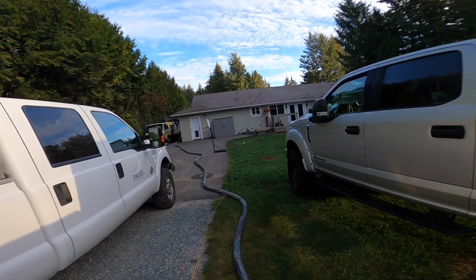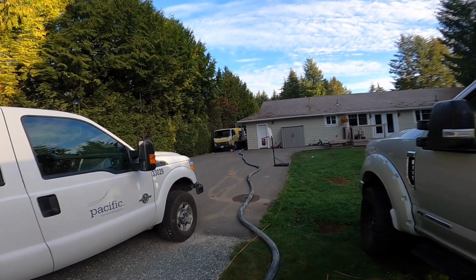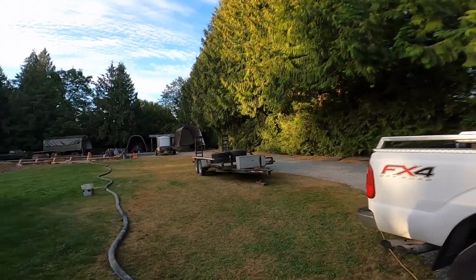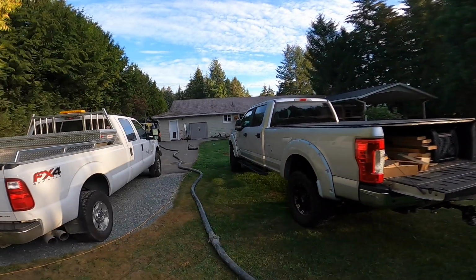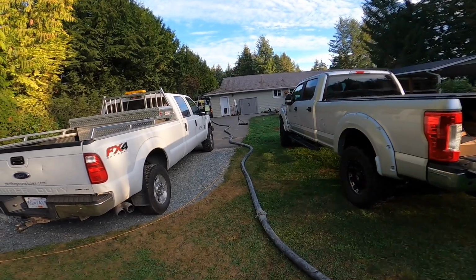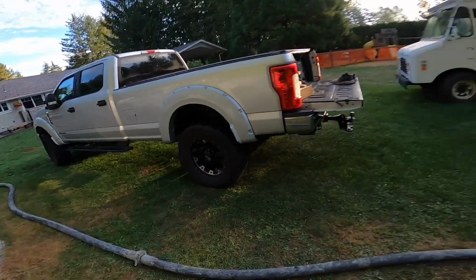You think about it, if you have a balloon and you pop a balloon that's inflated to 10 psi, no big deal. If you take a 100-gallon air tank and you have that at 20 psi and you pop it, huge explosion. Why? Stored energy. It's all about stored energy. So the more line you have, the more stored energy, the more careful you have to be, the more respectful that you have to be of things.